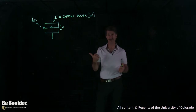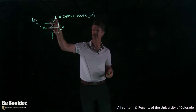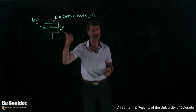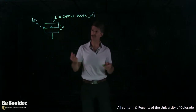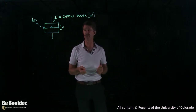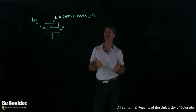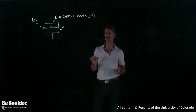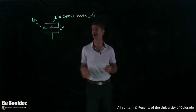You have to use photodiodes differently because they're a current device. This sensor gives you a current, not a voltage, not a resistance — so that's a new thing for us. And they're much more sensitive than a photoresistor. We can detect very, very small currents, much more so than we can detect small changes in resistance. They're better when you want to sense small amounts of optical power.